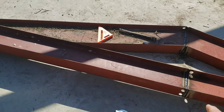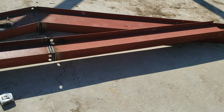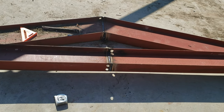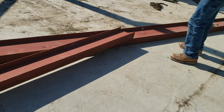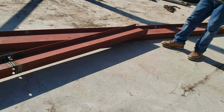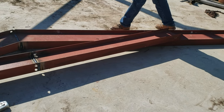I'm just going to put an extra I-beam up here in the top to spread that load out more and make this thing stronger, because it's kind of a wide building. And if we do get a fluke snow, which has happened, right, Cap? Oh, yeah. And everybody builds on these low pitches, and man, that snow piles up. A lot of these buildings go collapsing.